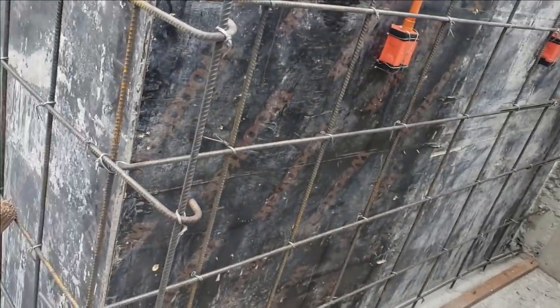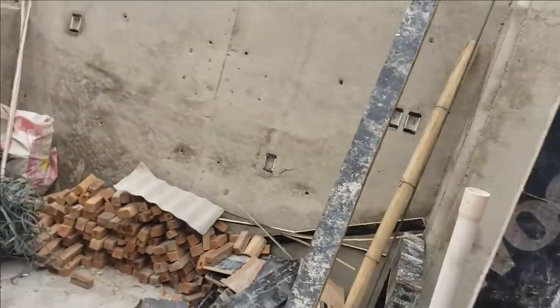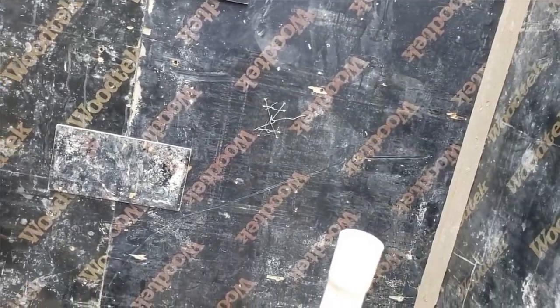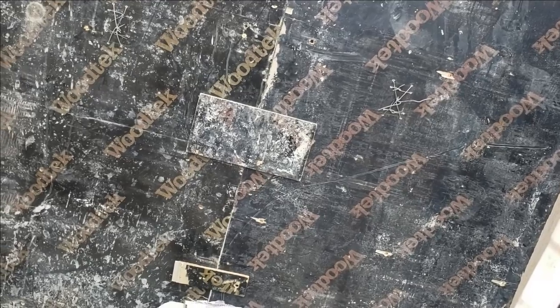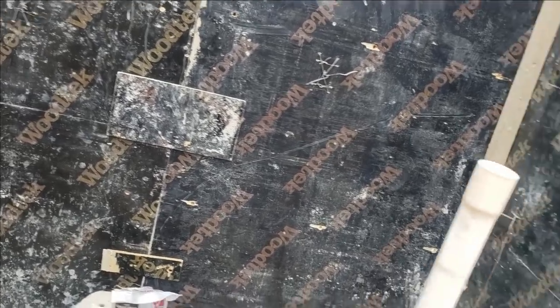So if you can, in your design, try to stick with increments of 4 foot and 8 foot. Maybe you want to split one sheet, and you can make a 10 foot wall, 2 fours and a two, and you can use that 2 foot sheet again and again. You'll end up with a couple of them, but just try to be wise on it.